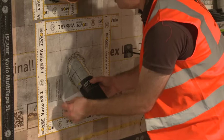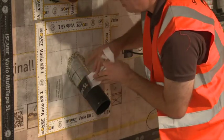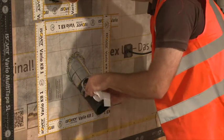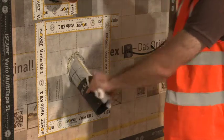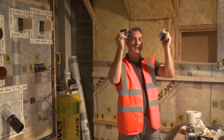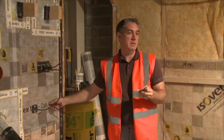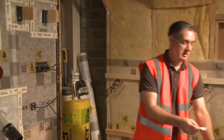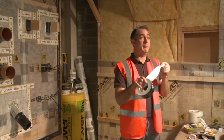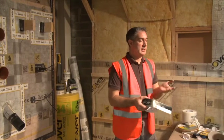Skim will only take to the plasterable tape. Four small bits of tape that size can detail that cable penetration without getting any leakage within that detail. This particular tape I'm using actually has a split back, which allows it to be folded in half to do one detail to another.